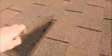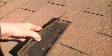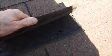So what happens is the water gets underneath the shingles and the water can seep right through the sides of the nail and then leak inside the home. So what I really recommend is to take off these shingles here, maybe 3 courses of shingles altogether. Once it's removed, in fact, this nail here was overdriven, so the water will get in there very easy.